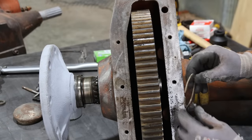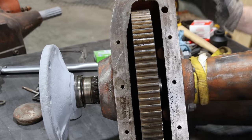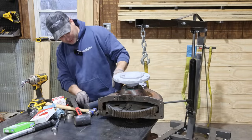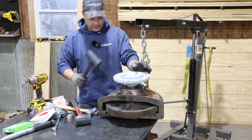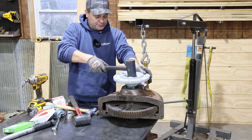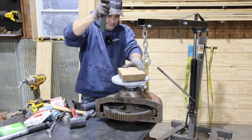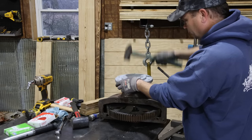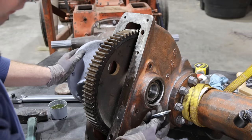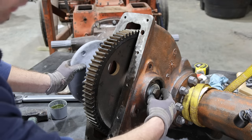A lock ring needs to go on inside of here — we need to get it on top of this wheel hub shaft and keep it there while we slide everything together. When I took this apart, the seal and bearing came out with the wheel hub and it was on there pretty good — I had to use a three-jaw puller, and on one of them I had to use a torch. So this is a press fit. I got it in far enough that I was able to get the bearing on this side started onto the shaft, and now I'm going to use a bolt and a few washers to see if I can pull everything that direction and bring it together. Hopefully this works.